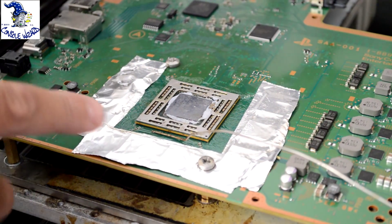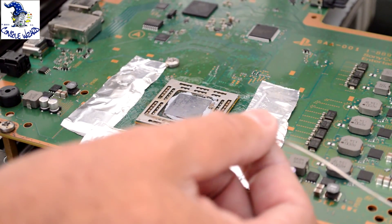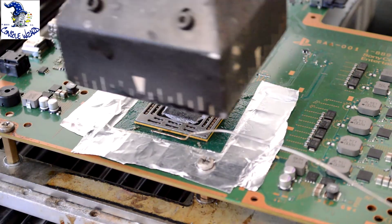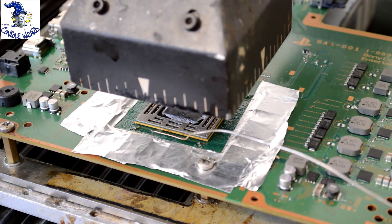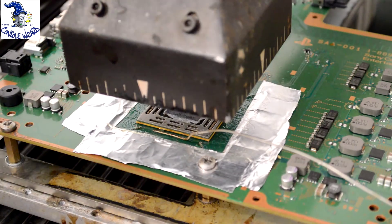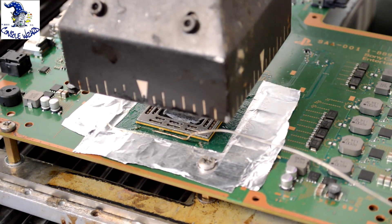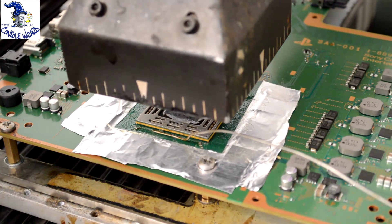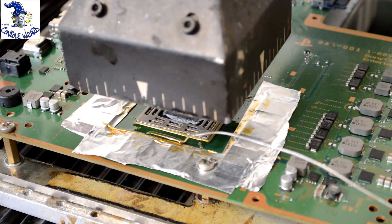The chip is nicely lined up on the main board. Now we've got the temperature probe in place, we'll select the program for the machine, making sure the top piece is lined up, and then we'll start it. The machine's now started, and when that finishes the board is then ready to reassemble back into the console.